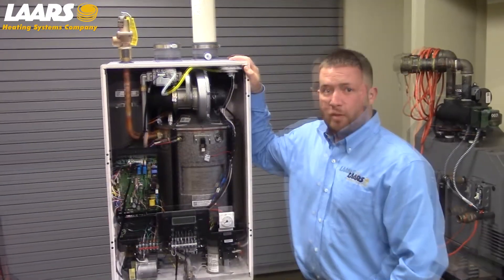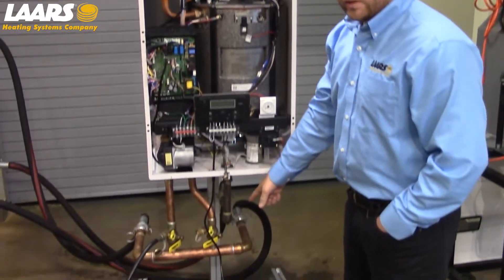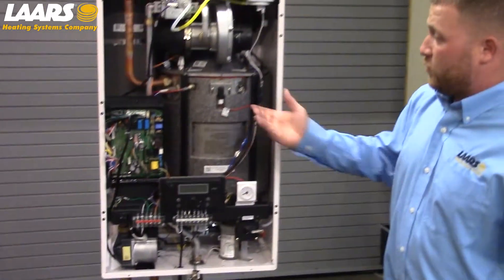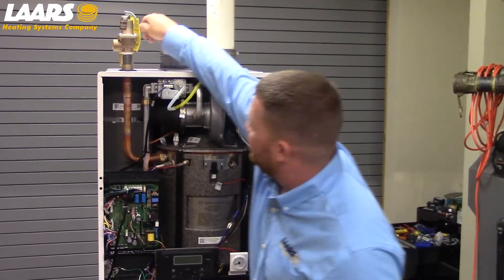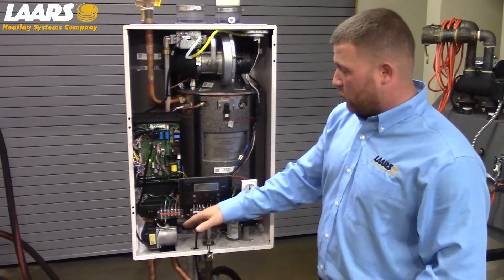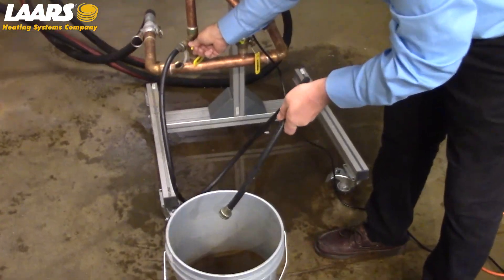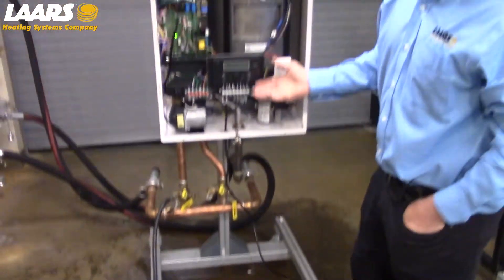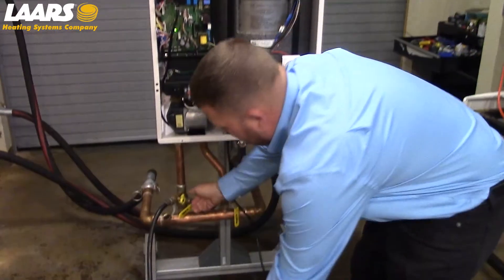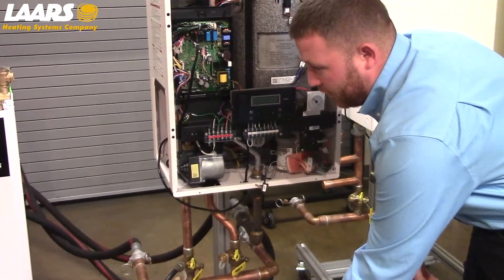This is how to properly fill and purge the combination boiler. I'm first going to start by loosening the cap on our air elimination device and filling from the inlet side of the heat exchanger. I like to slowly crack the valve so the boiler fills slowly. It's important to note that a combination boiler is shipped in domestic hot water priority mode, meaning the three-way valve is closed to allow all priority to the domestic hot water heat exchanger — so we're not going to get any flow on the outlet side. What we need to do is energize the three-way valve to open it up. To do that, power the boiler on and give it a call for heat. Now after you have water flow on the outlet side of your heat exchanger, please power your display off — that will capture the three-way valve in the open position.